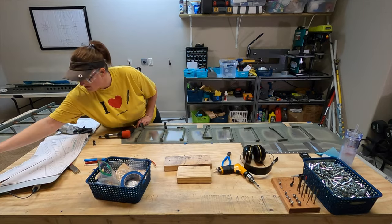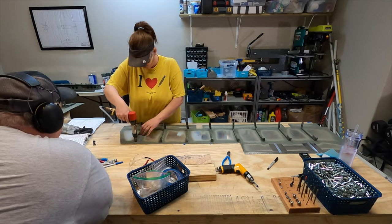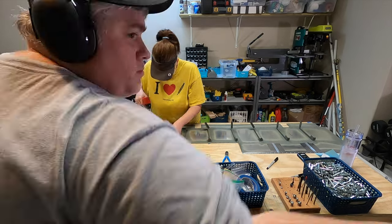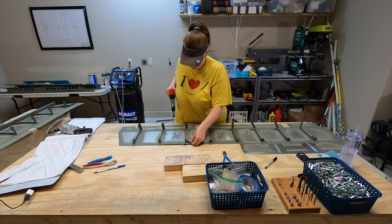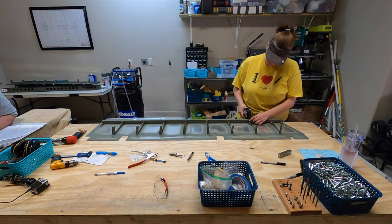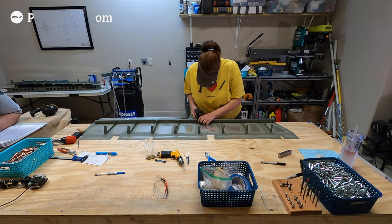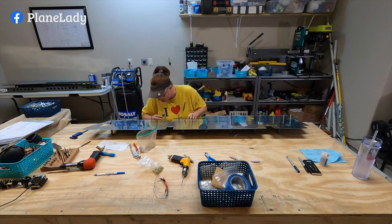On the bigger half of the ribs — the one with the little smiley face — the smiley face bit got in the way of the beehive on the rivet gun. I found that if I started riveting on the smaller, aft-most end of that larger rib half and worked my way forward, I could gently push the smiley face bit out of the way and then rivet that one rivet at the forward-most end. When riveting the rear spars on afterward, you can use the squeezer for the whole thing — just move the aft end of the skin to the table edge so it can flex out of your way.